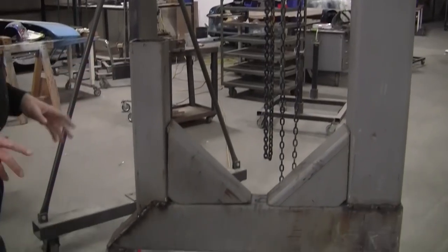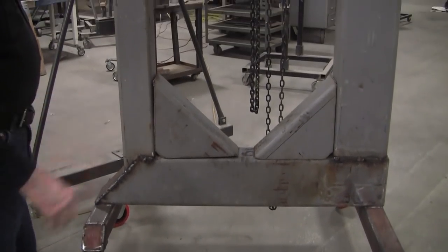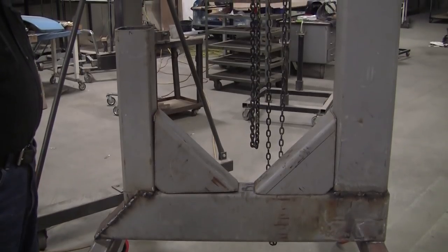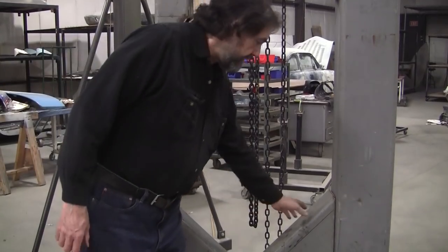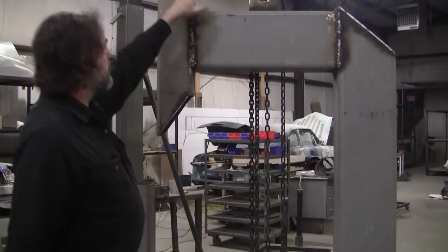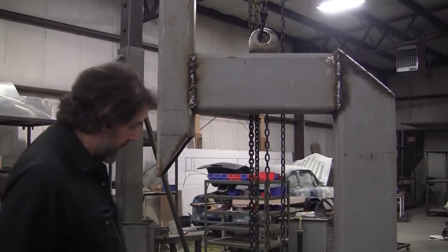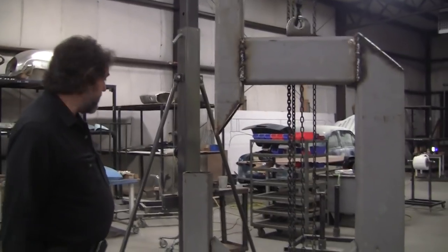We're going to lay the machine down. We've got these A-frames to lift it up with, and we'll lay it down, and we'll do all the welds on a horizontal plane. It makes them a lot easier to do. Frank's been cutting up these 45 gussets. We're going to get those in here. We're going to put one in here, and then get them all welded up. And then we'll lay the thing down and do all our welds much better.